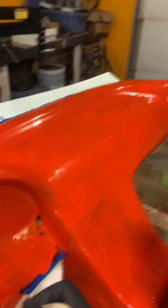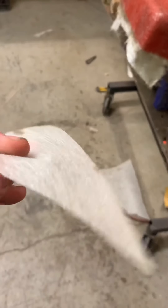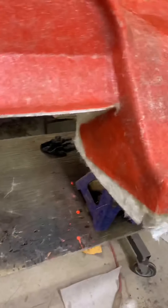The dash has now had a good surface veil laid, which is thin fiberglass so it doesn't bleed right through the gel coat. We did a layer of that, and then three layers of one and a half ounce chopped strand mat. Now it's time to take a flapper disc and take all the excess edges off, and then it's time to pop it out. Got all that trimmed — cut off all the excess and took a flapper disc down to the material.